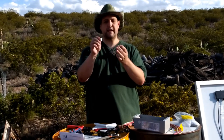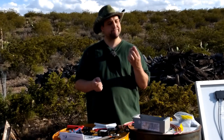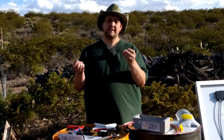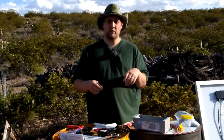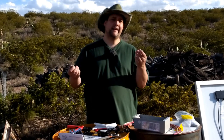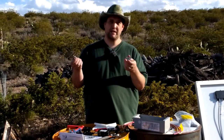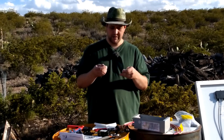This is an electrical connection, so I'm going to put some of that anti-oxidant goop there. Yes, these are tinplated and supposed to resist corrosion, but I'm paranoid and I like my stuff to last 50 years or longer. I'm using a torque screwdriver — we're going to put 30 inch-pounds on this connector to make certain it's on there correctly.